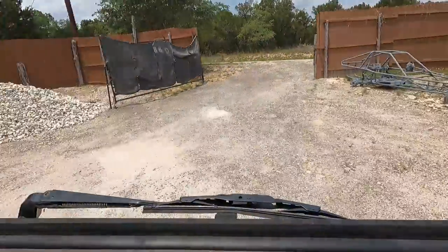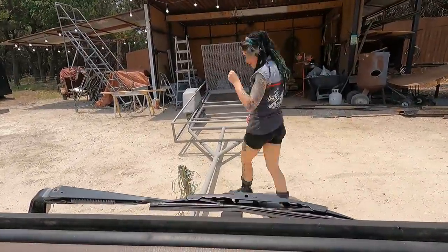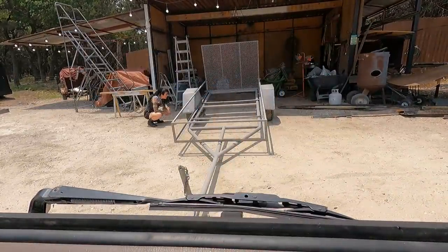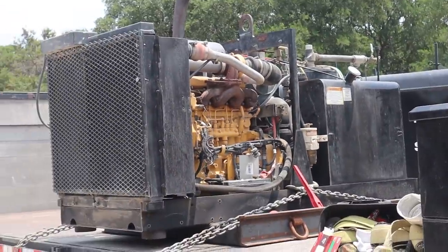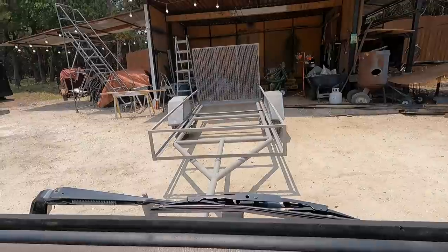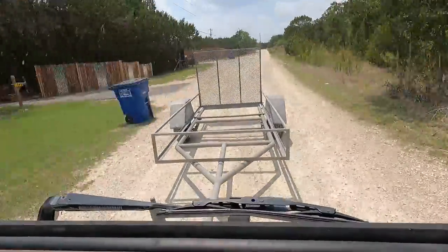You could glass bead the parts. The problem with galvanizing is the way that it's made, it actually embeds itself in the metal. So when they galvanize something, it's like a paint, but it actually embeds itself in there, and that's what protects it. It's a galvanized coating to keep it from rusting. Try to take a galvanized pipe from Home Depot or whatever, and start grinding it. It's pretty thick. You'll see this shiny silver, that's the galvanizing, and you'll start grinding, and then you'll get to the metal, and it's in there. Because it's not just a coating, it's actually embedded itself in the metal.